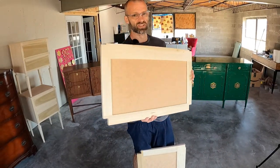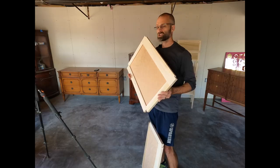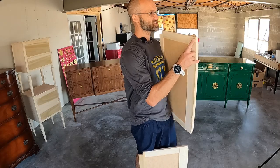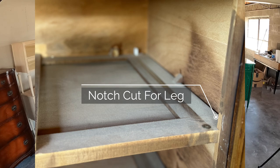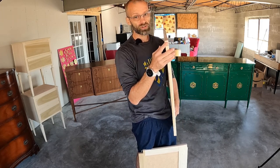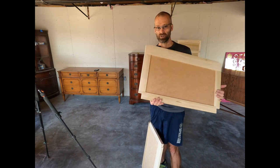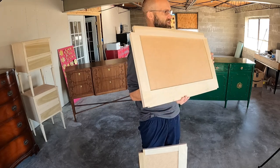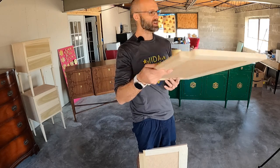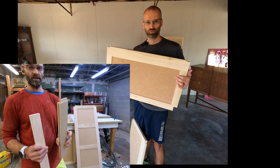Here I've got just a basic framing panel. This is what we put on all our furniture here at the Resplendent Crow. This is what you're going to see in traditional furniture, in high-end furniture — the guts of a cabinet. The important thing to understand is we have notches cut in here for where the legs go. Traditional furniture has legs — a front leg and a back leg — and we have notches cut out for all those things, because this is how you make a strong cabinet. The construction, in this case, is poplar — a poplar frame. The joinery is tongue and groove, which is pretty much a fundamental of woodworking.